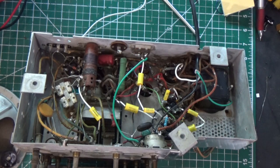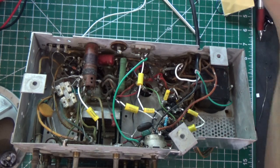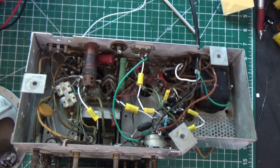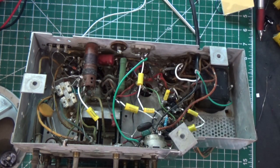One thing I discovered while doing this: before I changed the caps, I tried the shortwave band. You've got to try it at night. I got absolutely nothing out of it. By replacing this 0.05 cap, I actually fixed the shortwave, which was great. I don't want you to confuse this with ripping parts out for the sake of it — this truly gets us back to baseline, back to what the engineers were thinking when they designed and built the radio.